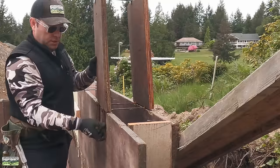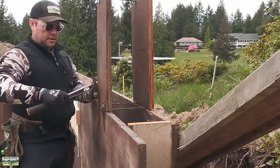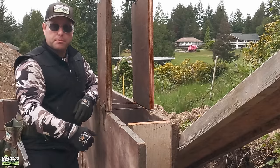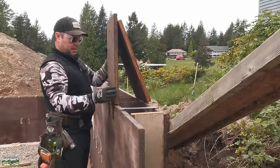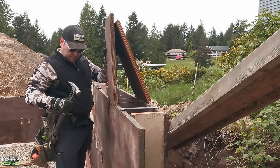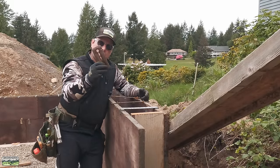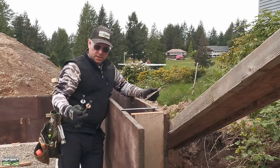There's how that works. All you do is flip these over, finger tight, and that's it. After we pour concrete and strip the walls the next day or days later, pop these off and bust off the snap ties. Snap ties stay in the concrete, so you're paying for those on each job. The shoes you buy one time and just keep reusing them.